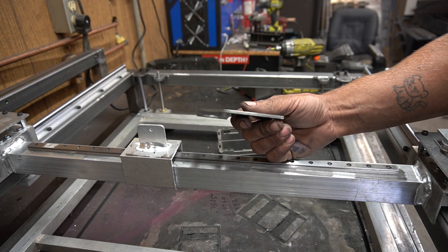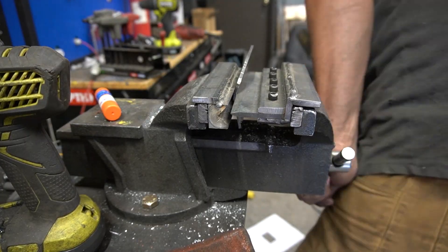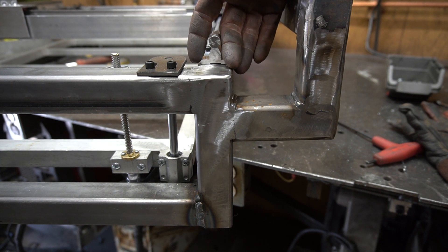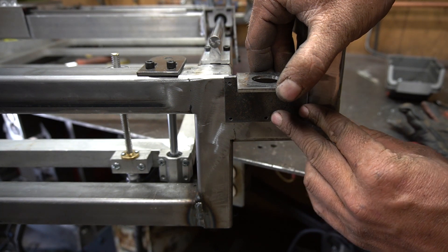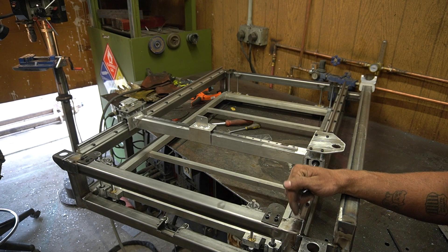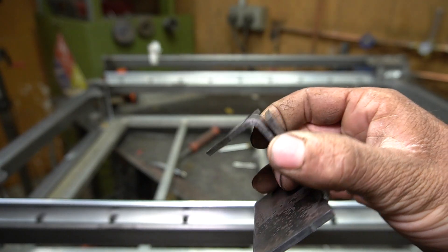For the Y-axis I'm going to run this with two separate stepper motors because NEMA 17s are pretty cheap and I don't have enough pillow block bearings to do it with one. I've cut out these two brackets on the plasma cutter — let's get these bent up and installed. I made a bit of an oopsie: as the real-life machine drifts from the CAD model, I forgot to adjust parts accordingly, so these center punches that were supposed to be mounting holes aren't actually on anything. Going with the lazy solution — just weld it. With our two stepper mounts installed we just need tensioners on each side, so I cut out the same parts with no holes and welded them in place.